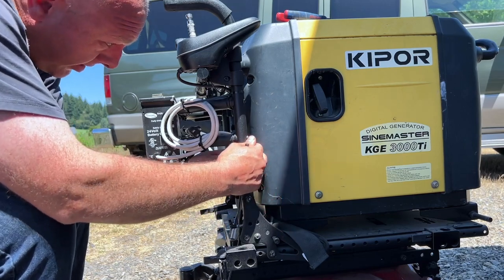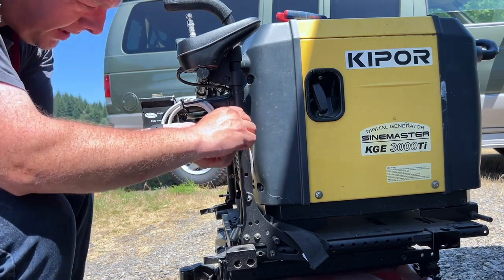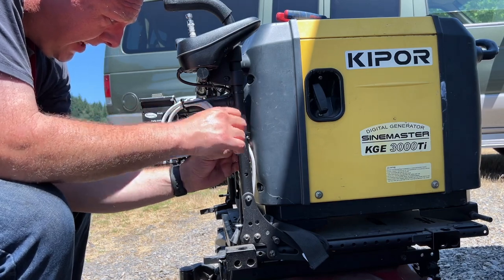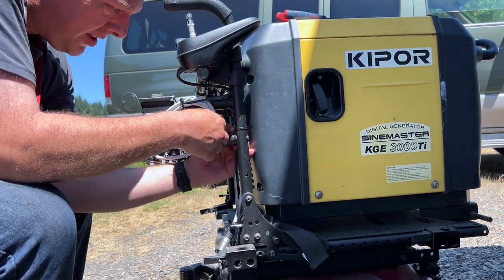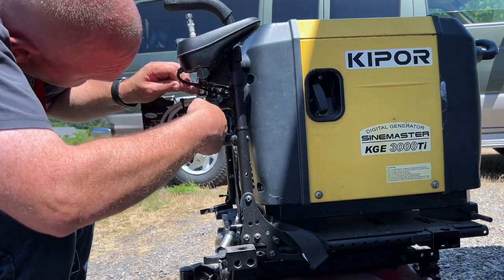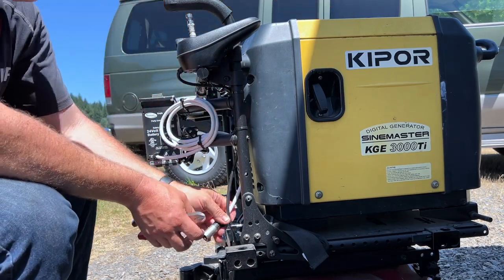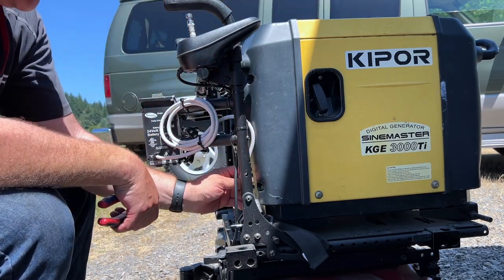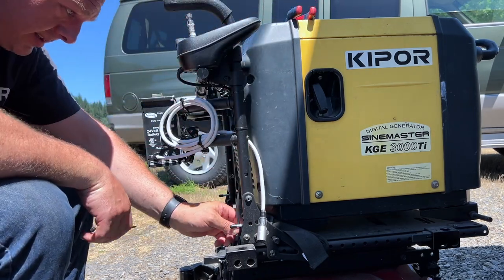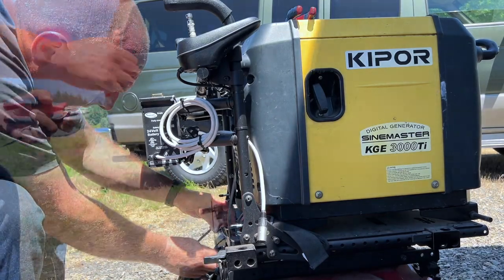Right now, when you plug it into the chair, it triggers the charge inhibit, but it's pretty easy to modify the cable so that doesn't happen. And seeing as how it doesn't really matter if the charger's engaged while it's moving, because it's all self-contained and whatnot, we're gonna defeat the inhibit, which is actually done right here in this connector on the charging cable. So let me finish getting this wire routed, and then we can take a look at that. Let's see if it still moves.